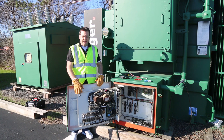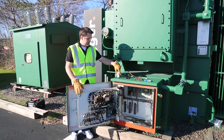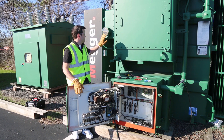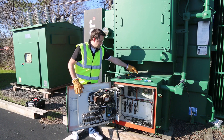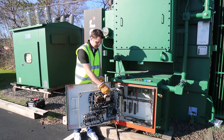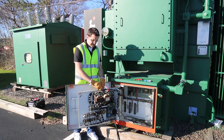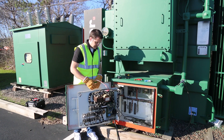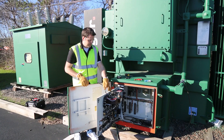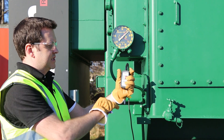I've already connected since we've done this a few times before. The first device I'll be showing is our remote tap controller — a simple switch device that will allow us to control the tap changer. I connected three leads: one for raise, one for common, and one for lower. Now I'll turn on the power to the tap changer and show it in operation. With the remote tap controller you'll see that you have up and down, which corresponds to raise and lower.